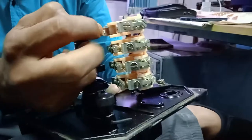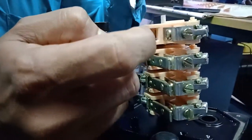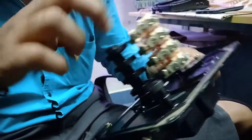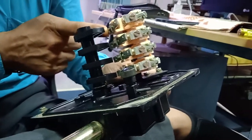Here two contacts are there. This is one contact and this is one contact, but in normal condition both are connected — you will get normally closed. Once this cam operates and presses here, it will become normally open.